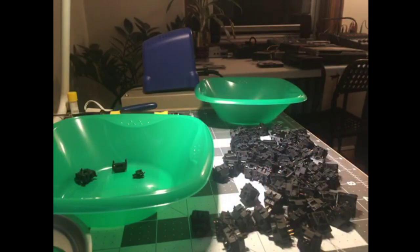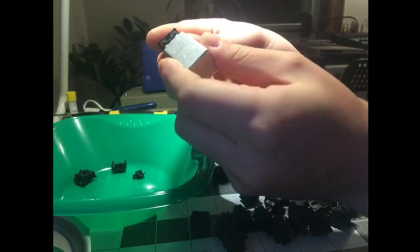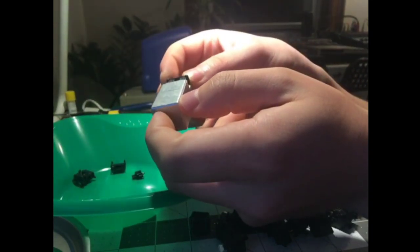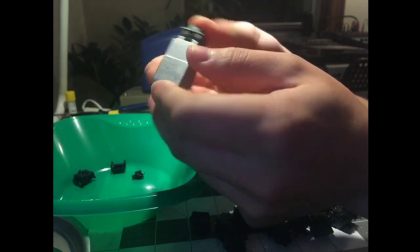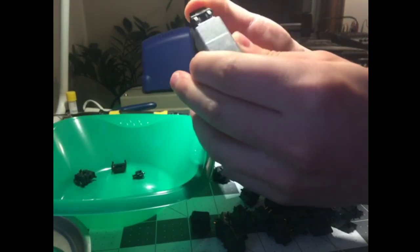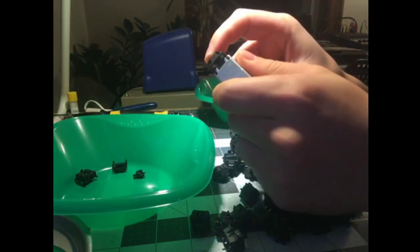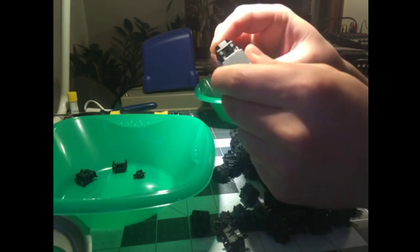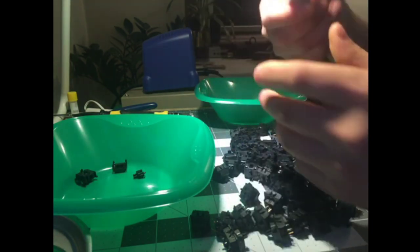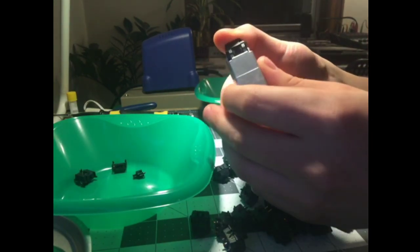Yes, exactly, Bezo. That's a really important tip, and that's actually why I like this tool so much. Yeah, so these plastic latches are somewhat delicate. The plastic material is kind of soft, and if you jam it, I'm going to do it on one because these are cheap switches, if you jam it all the way down, on most switch openers, actually, it would damage the plastic. On this one, what I really like about it is that it's really hard to jam it far down enough to actually damage the latches. So even if you're really an animal and you just go at it, you're probably not going to bend the latches too far beyond what they need to bend.